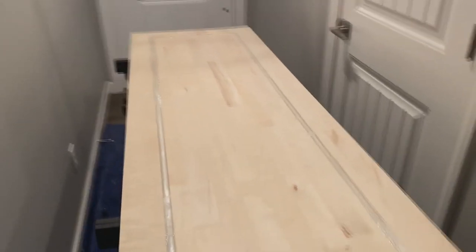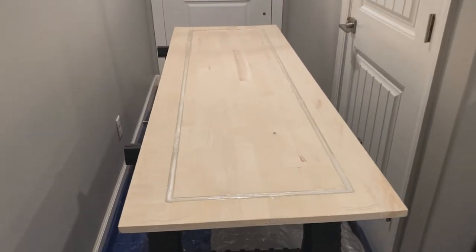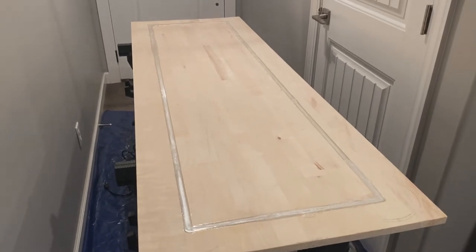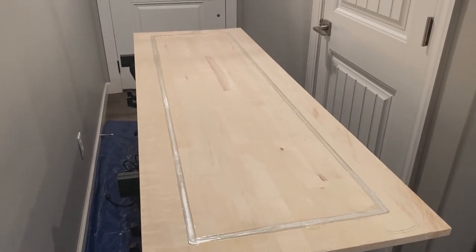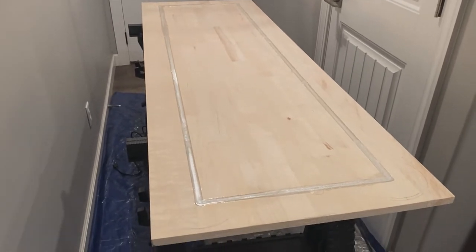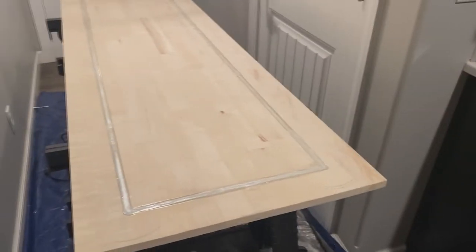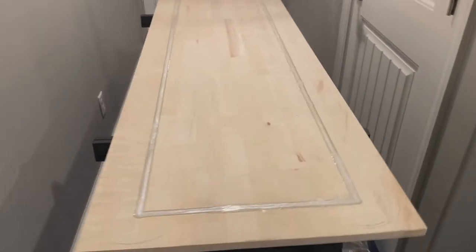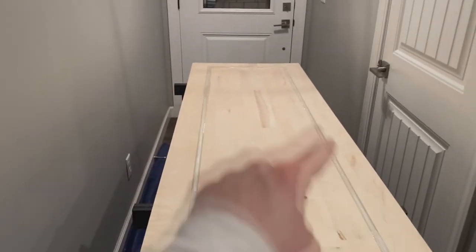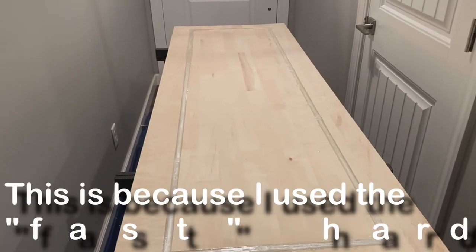We finished the epoxy pour, probably did a lot of things incorrectly. The first thing we did incorrectly was we filled half a quart worth of, I don't even know. It was a lot. Filled a big cup, almost a small bucket, full of epoxy, mixed the pigment in, and then started to pour it. By the time I got to that corner, I started in that one. By the time I got to that one, the thing was smoking hot in my hand. I mean, really hot.